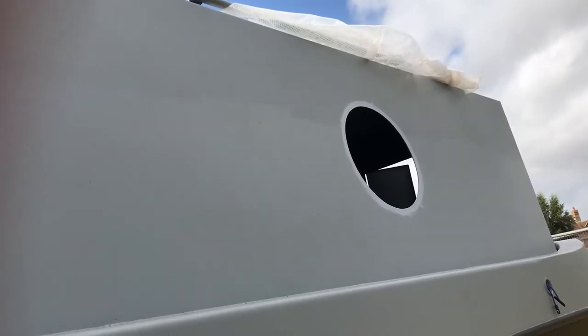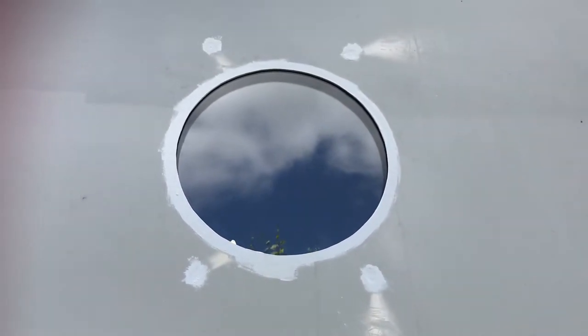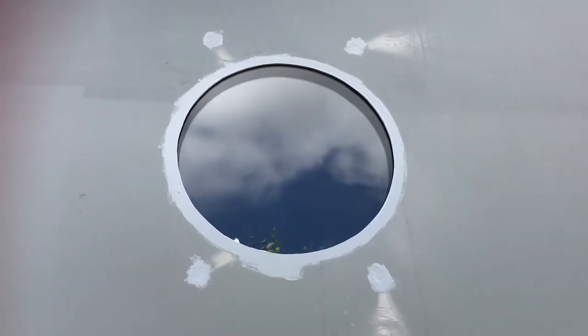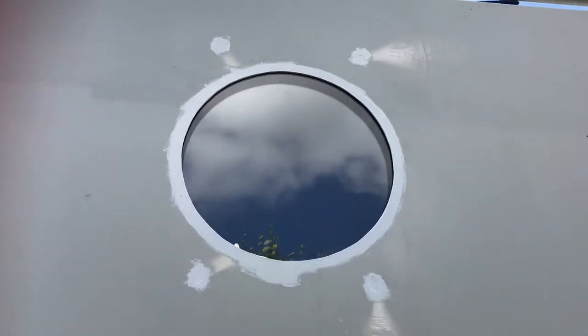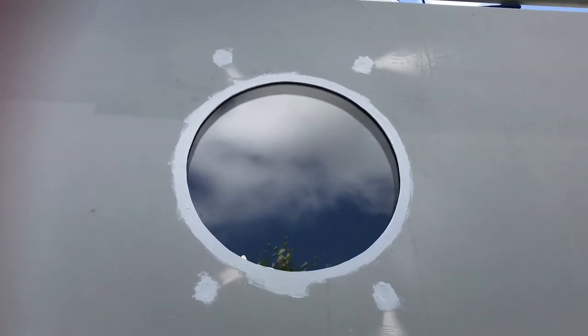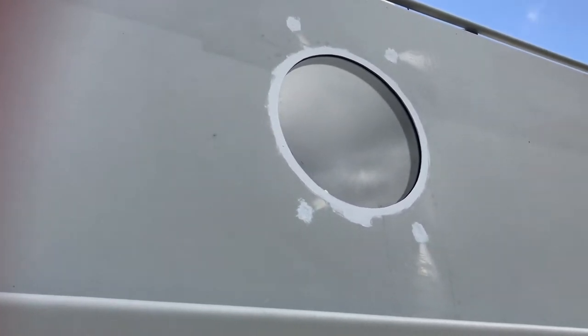These are standard 18-inch holes cut in the boat which would take a standard porthole. I've put in a double-glazed pack — a standard UPVC type house window that would normally be fitted in houses. The cost is quite cheap; I'm paying £20 per window for the glass alone. What it gives me is the thermal break I'm looking for, because there's no metal frame, and when I looked into metal frames with thermal breaks the price gets hideous.